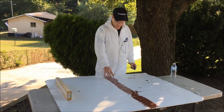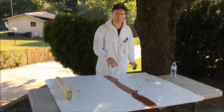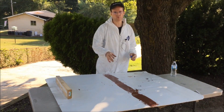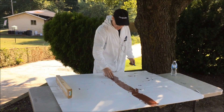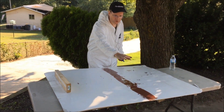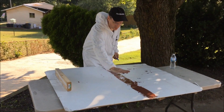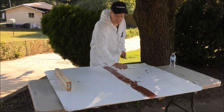So we did two batches of the Phenolic Micro Balloons and the epoxy resin. The first one was too thick and it flashed over. The second one — I guess this is the Goldilocks one — we did it just right. Looks terrible now, but tomorrow this will be sandable and we'll be able to sand it down so that crease that was there would be gone.